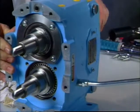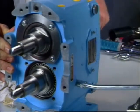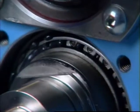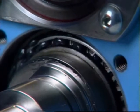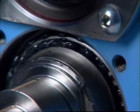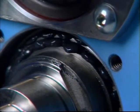After you've removed the fluid end from the gear case, remove the bearing retainers. Grease the front and rear bearings through the grease fittings until grease is visible around the ball assemblies. Rotating the shafts while you grease helps disperse the grease properly. Hand packing grease into the bearings also is acceptable.